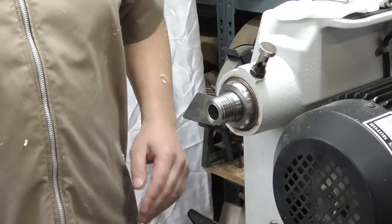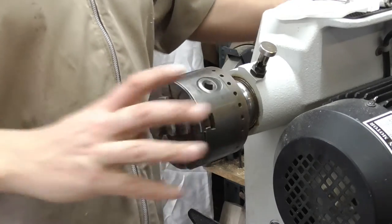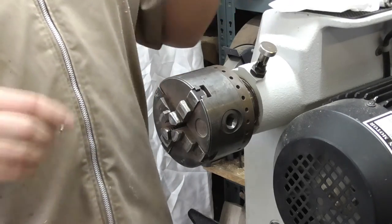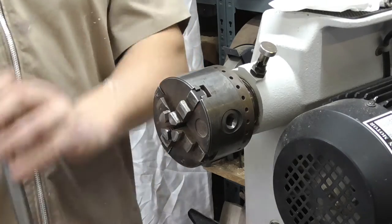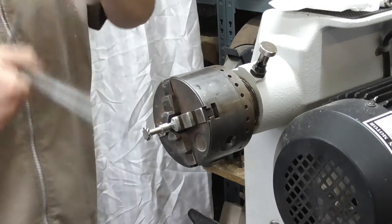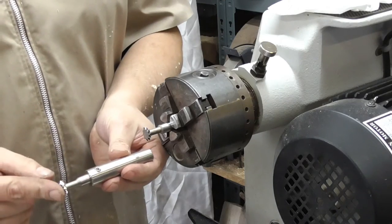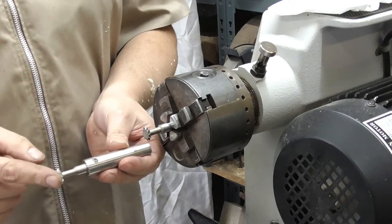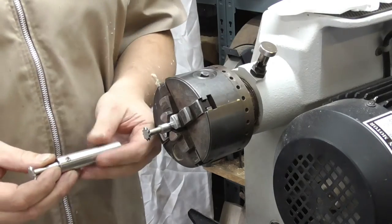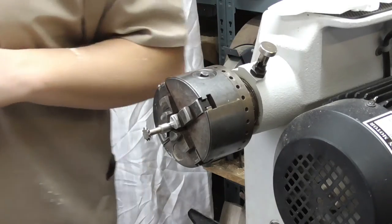There are a couple of ways of actually mounting up the cutter. You could use a spare chuck, or just use a standard chuck and take the jaws off and use the carriers. This is my AXminster with the engineering jaws, which are quite nice — you could hold the cutter which has a 10mm shaft like so. Or you could use the two morse taper cutter holder. This also works nicely and it's an optional extra for those who just don't have spare chucks.